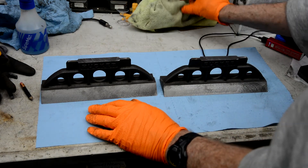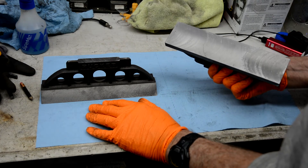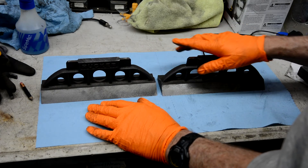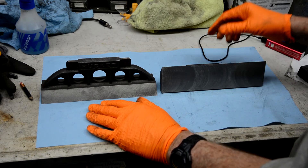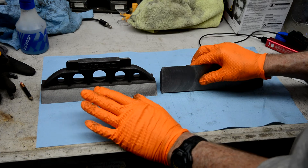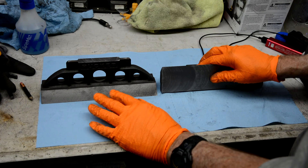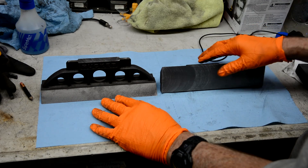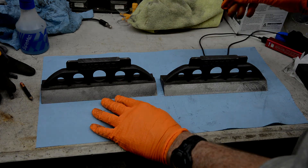Now when we start scraping, Richard King always says if you've got to take more than five thousandths, then it's better to machine it. I'm sure these are way better than five thousandths. When you start scraping, your cuts are deep — probably half a thousandth if you're doing it right when you're going across on your initial passes. I'll get all into that when we get into the scraping part of it. But for now, they're all machined and ready for scraping.